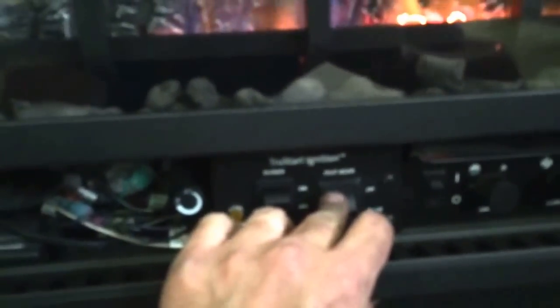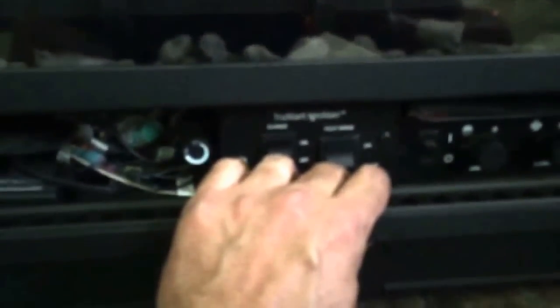Open this bottom grill. You've got your thermostat, off, or on settings. I've got it hooked up to a remote control thermostat. Here's the receiver for the remote control right here. You can switch it to pilot or IPI, which is electronic pilot. You've got your blower controls over here — that's all the way on high.